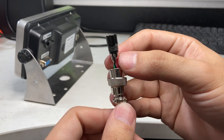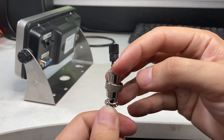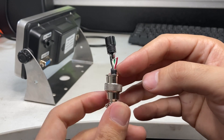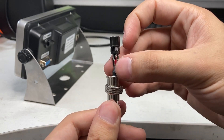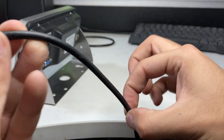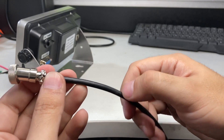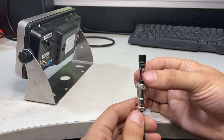It was always going to read zero. If one of these wires is loose, your scale will never work. This is my problem and why it's always staying at zero — no matter if I put weight on it, no matter if I calibrate. It's a wiring issue. I checked the entire length of the cable and there are no smashed or cut areas.